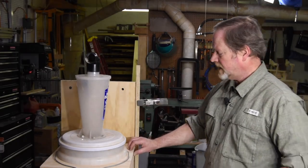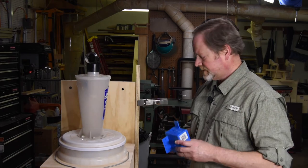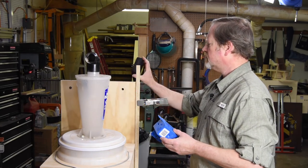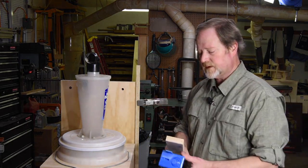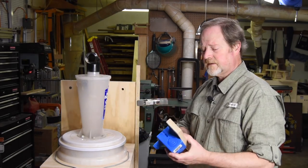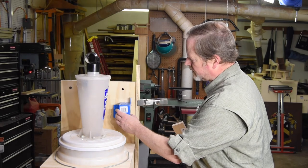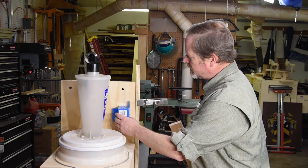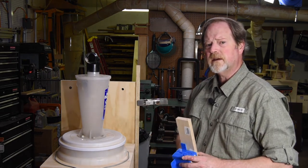Well, okay, I've done a little pre-assembly, nothing screwed in place, it's just sitting here, and I'm looking at how I'm going to put my box in place. I want to place the box such that my electrical switch unit does not come past this plate right here. So I think what I'm going to do is take a piece of scrap, not this piece of scrap, and use that as a backer to push it far enough over. This gives me enough clearance. So I'm going to take this down. I'm going to get this probably vertically, maybe about here. I want to be clear of my attachment hardware, my barrels there. Probably about there. I'll take myself a bigger piece of scrap, and I'll cut the hole in here with a drill and a jigsaw.